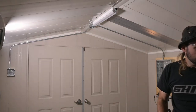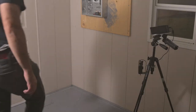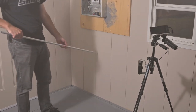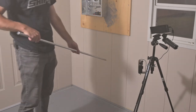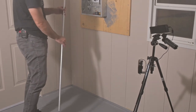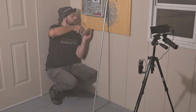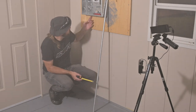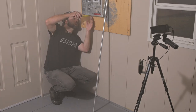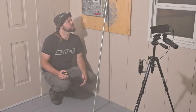I don't want to be done — I was having fun. Oh, what else can I do? Well, I can't do any more lights. Maybe I move on to doing a receptacle. My target is to have a receptacle like right here or here — I'm thinking here. So this piece should get me there. And now is when we have to get into offset bends. That's three quarter inches — we know that much. And then we have to pick a hole. Maybe this guy here. That's a box offset — that's like almost immeasurable, like a quarter of an inch. That's a one inch offset we need, so that's two inches of bend.